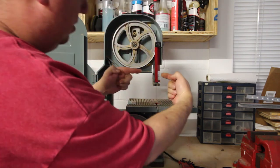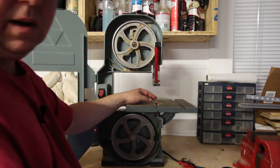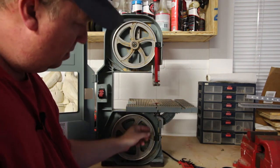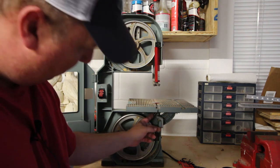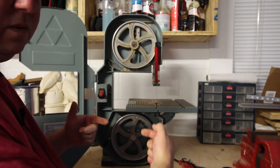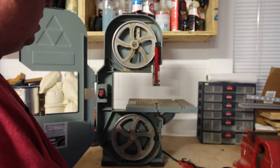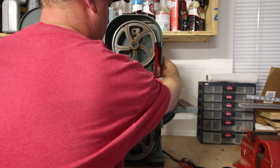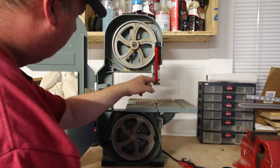There are actually two pins that come in right here and the blade needs to be centered on those two pins — it's running right down the middle. Under here there's another roller oriented this way, and the blade is supposed to sit 1/32 of an inch or less off that roller as well. It is — it's dead in line, I can feel it with my finger. Same thing down here: two pins and it sits between those two. There's also an adjustment here for the guard — it goes up and down, still sits between the two pins, sitting right above the roller.